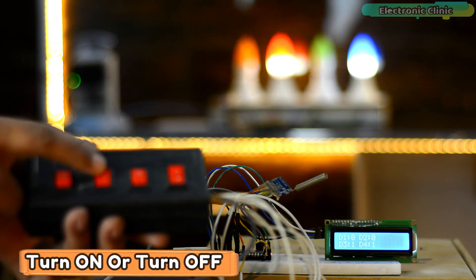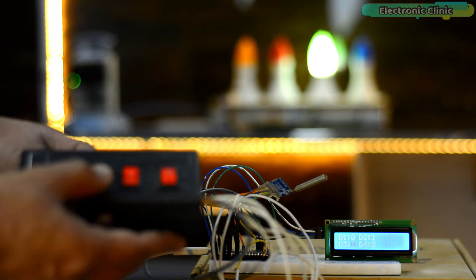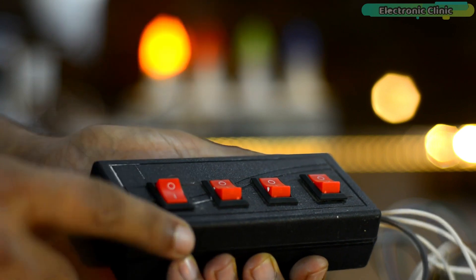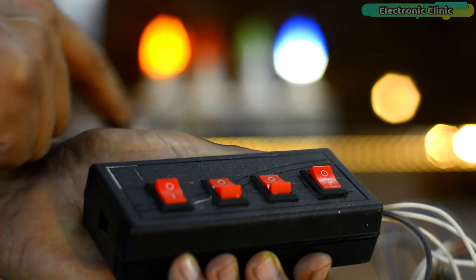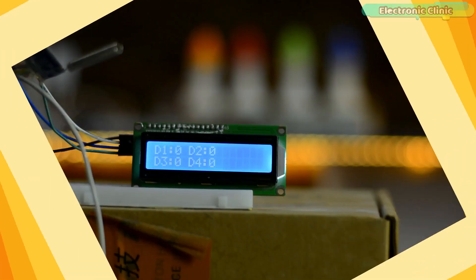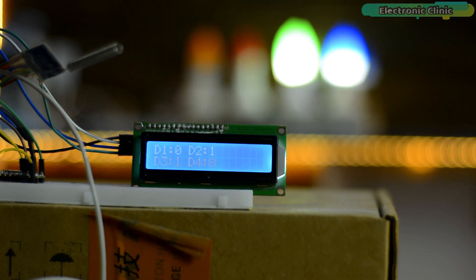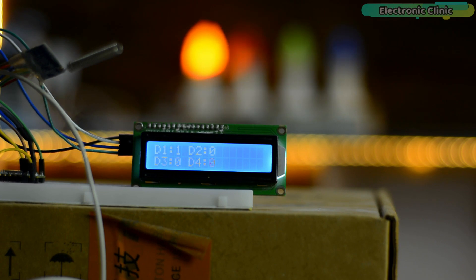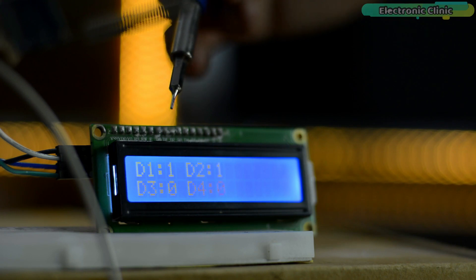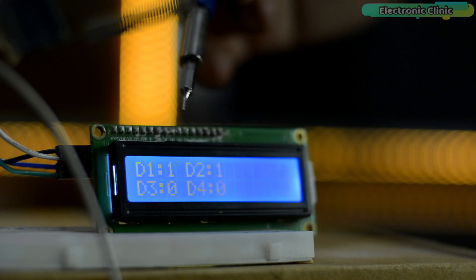I can randomly turn on or turn off any light and it is working quite superbly. This small delay occurs because I have used timers on the transmitter and receiver side — you can increase or decrease the timer value if you want. This Raspberry Pi Pico and LoRa based automation system presents quite a practical look. Whenever I turn on or off any button on the transmitter side, the receiver side sends me feedback whether that load has turned on or not. Now even if I don't see the electrical appliances, there is no problem because I keep on receiving feedback from the receiver side. If there is some issue on the receiver side, I will not receive any feedback, and if I get out of range, I will also receive no feedback.